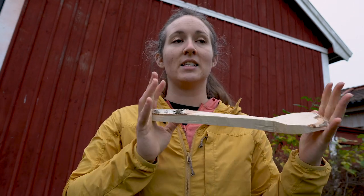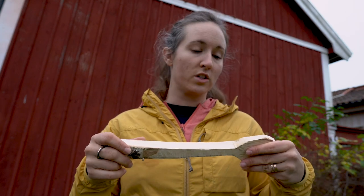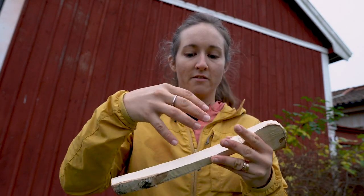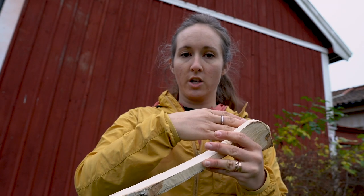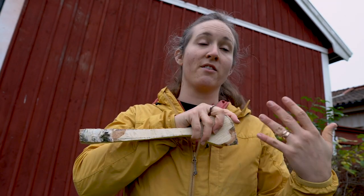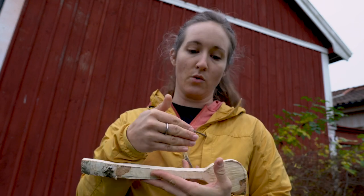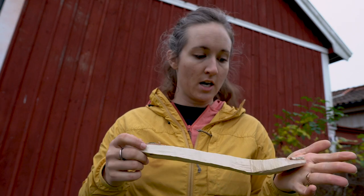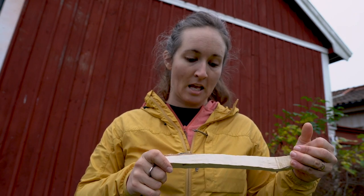Be warned, if you put it in a plastic bag without putting it in a fridge particularly, or a freezer, if it's there for a long time, it can start to rot or spalt. Spalting is the fungus, the action of fungus growing through the wood grain. It can be quite prominent in a lot of pieces. It can be very beautiful, but it also weakens the wood. So you don't want that to go too far. So be aware of that.